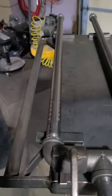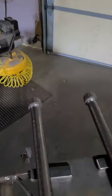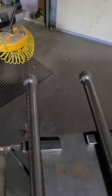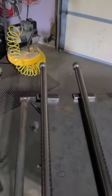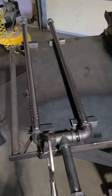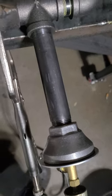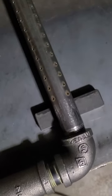I'm going to build heat shields for these here soon. I put caps on the end. I did not weld or crimp the ends — I want to be able to access those holes on the inside of the pipe from that side. I used a yellow high-grade, high-temp putty instead of tape. The only area I used tape was on here, and it's already buried inside the Venturi. As for that joint and the others, I used putty and then cleaned up the putty as much as I could.